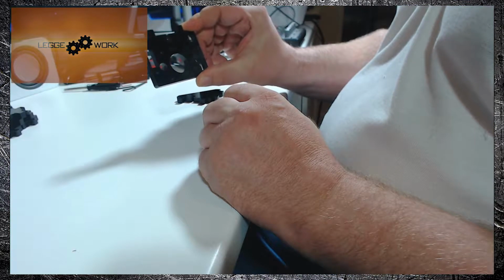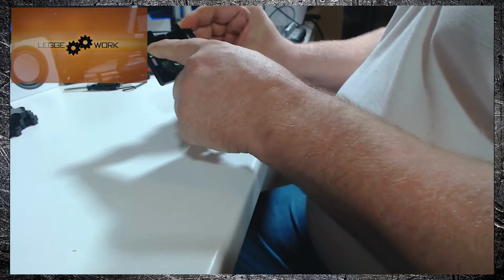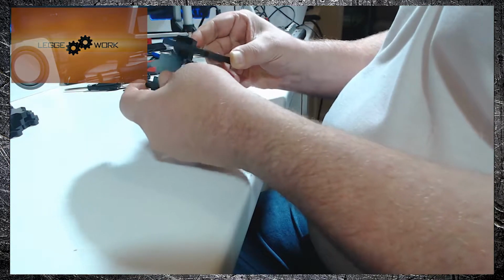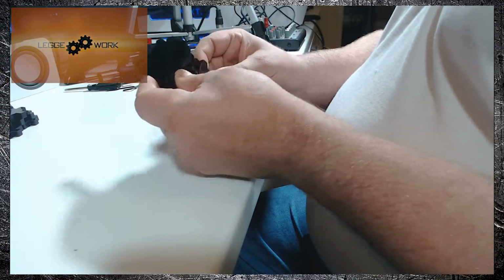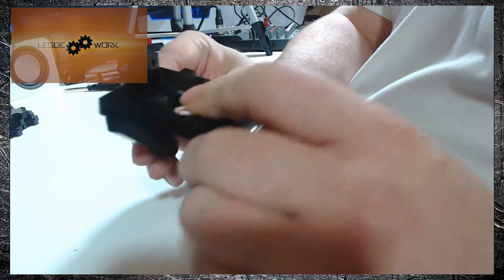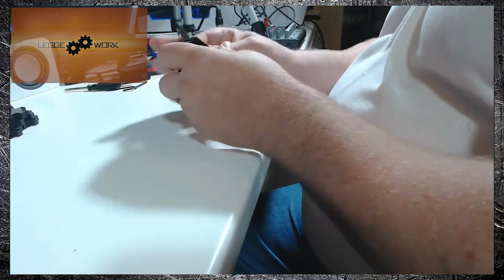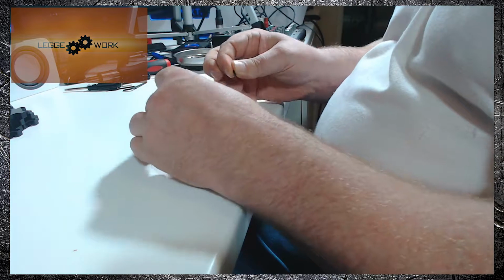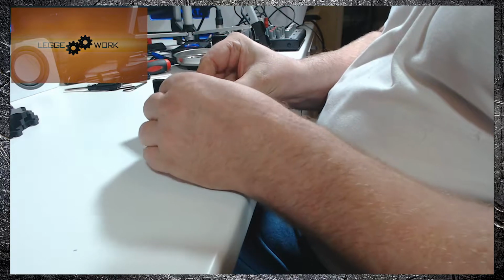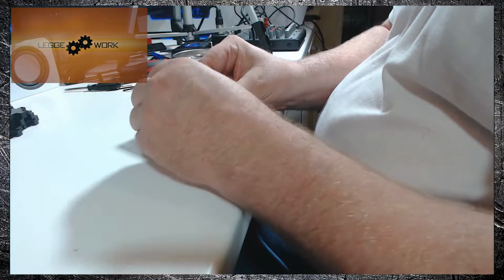So first we'll do the left hand side. So you want to orientate A04 in that manner with the large slot to the left hand side. Place in the side piece with the long tail, like that. Then you want to fix it in place with a square nut, and an M3 screw through the front.